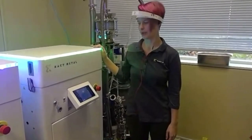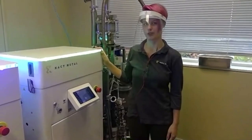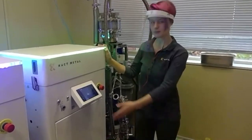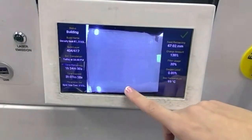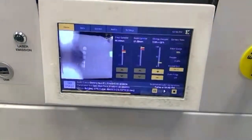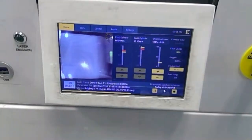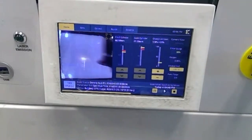As you can see on this printer that's running, we have a green light — these LEDs are status indicating. The blue light on the previous printer indicated that the printer was in an idle state, whereas green indicates that the printer is running in a printing state. Here you can see on the front that the printer is actually printing. The display shows that the laser is emitting over the part and the recoater is bringing across more powder between layers. The feed and build cylinder positions are locked during the print so no one can change the position, but you can change the charge rate, which is the ratio of powder brought across between layers.